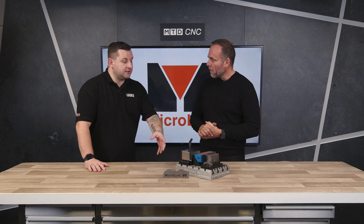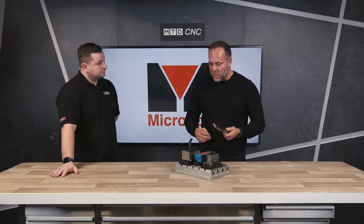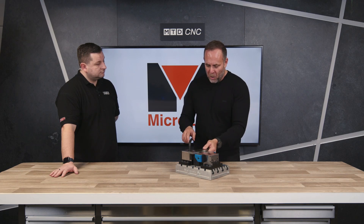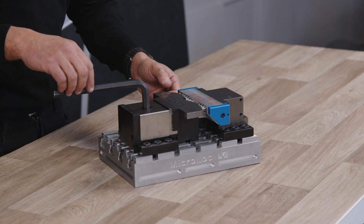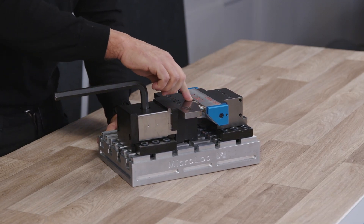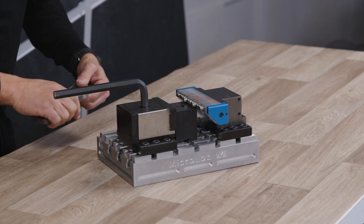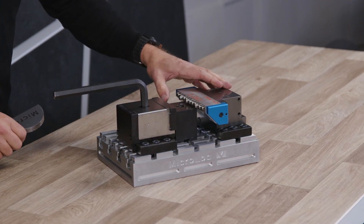So what's the advantage of using one of these jaws compared to the normal system where people will just be milling soft jaws over and over? Well of course they're still going to be used for soft jaws but the idea behind this is being able to change parts very quickly rather than having to machine jaws all the time. As you can see we've got a part here. We've got a parallel we can move up and down and we just put the jaw in, and as you can see as you clamp the part the pistons find the correct level to clamp it all around the vice. That's clamped all around that form very accurately, very quickly, very strong.